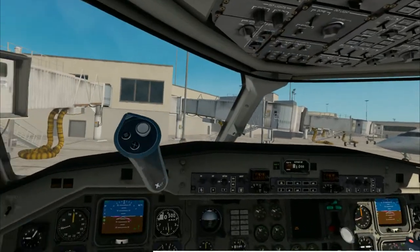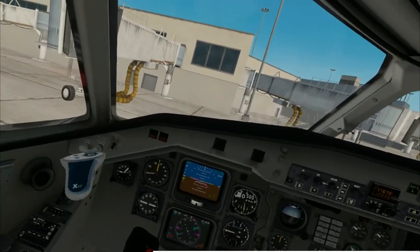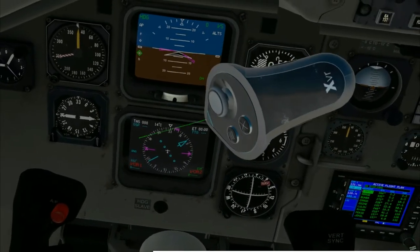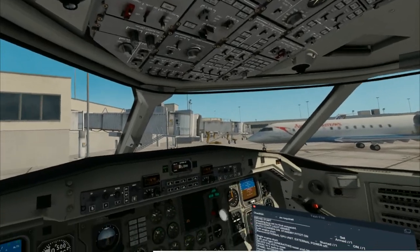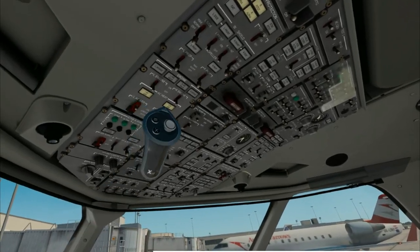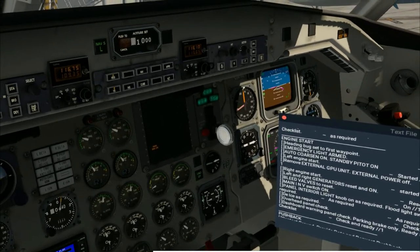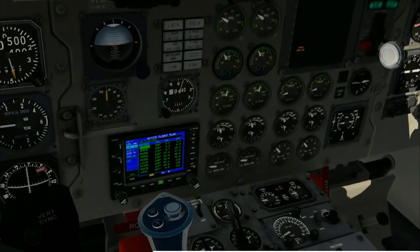That's your panel light for your overhead panel. Here's your floodlight if you need it — you turn that knob and it gives you some floodlight. We're not going to have to de-ice the aircraft, but this is where you would do it at this point if you did — it's 14 degrees Celsius. Up in the upper left quadrant of the overhead panel is your de-icing. Overhead panel check — those yellow warning lights right there should be the only ones on at this point. We'll check our dashboard warning panel, and the only thing lit up is the parking brake because we still have our parking brake on.